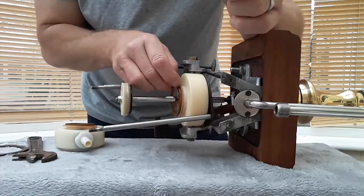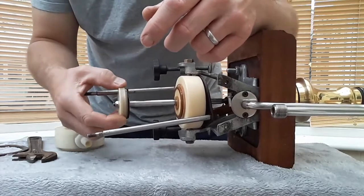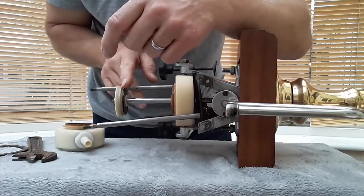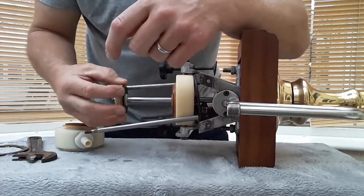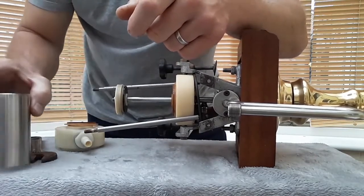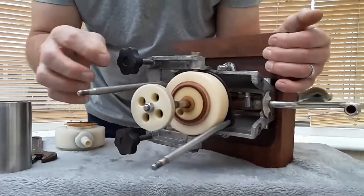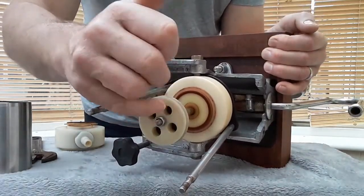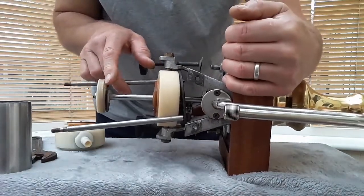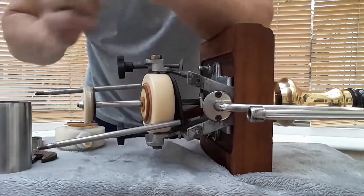You can see there's another seal at the other end for the stainless steel tube, and then this is your draw diaphragm. You've got a rubber diaphragm just here, and then this is a tight fit that goes around the cylinder nice and tightly, and that all, as it pulls through, allows the beer to come past it up through some holes here. So that, as you pull, the beer is sucked up through there, comes past the diaphragm by the diaphragm flexing, beer comes in and is pushed through, and as you pump it does that.